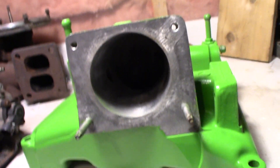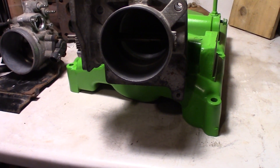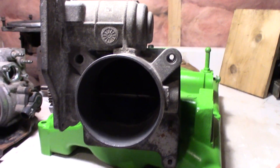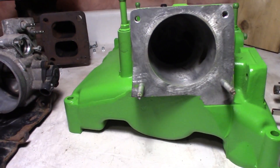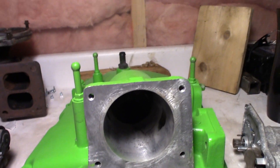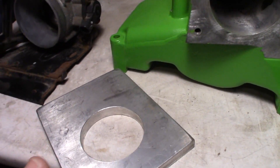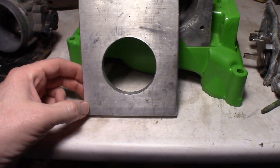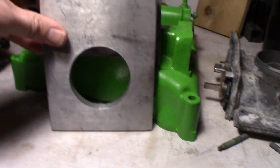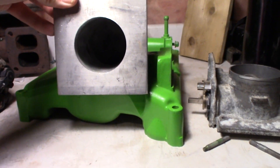To do that I need to make an adapter plate. This is an electronic throttle body — this one's from a 3500 V6, it's the same bolt pattern and slides on. First thing I need to do is get rid of these studs. Now I have those off, you can see how my plate lines up here. This is just aluminum I got made up, basically just had them cut it down to size and open the center up to two and a half inches.